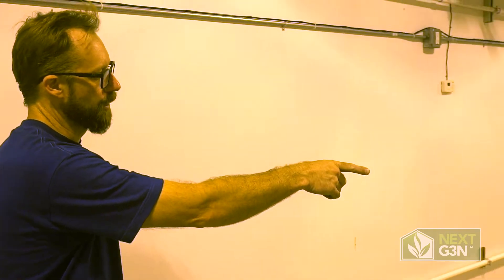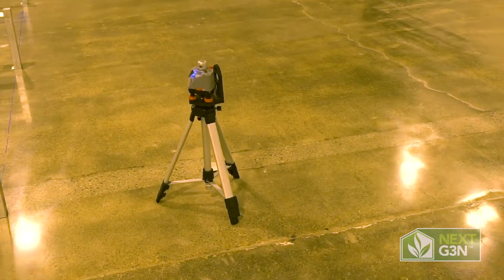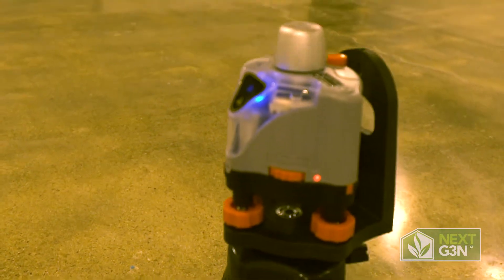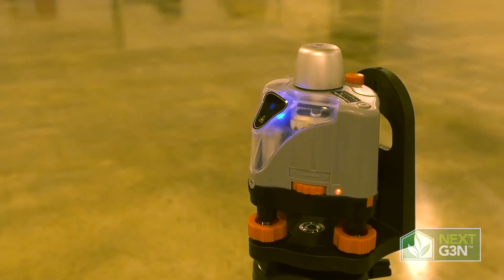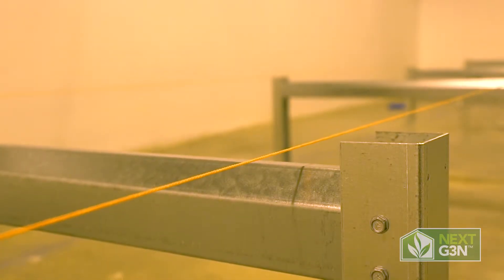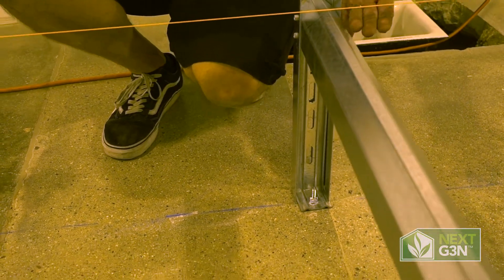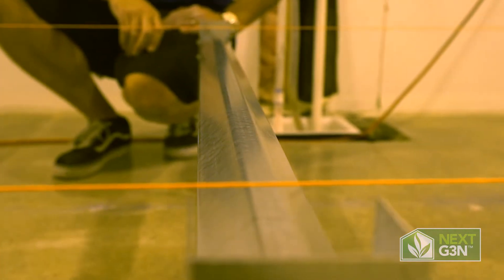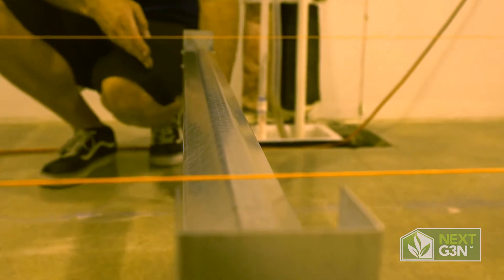What we set up over here is a rotating laser that we've leveled. The height of the laser itself doesn't matter. All it's going to allow us to do is measure down from the laser line and compare that line at both ends. What that does is ensure our string hasn't sagged excessively in the center — we don't want to create a swale in the bench. All of our legs in the center right now are at the full down position without hardware.